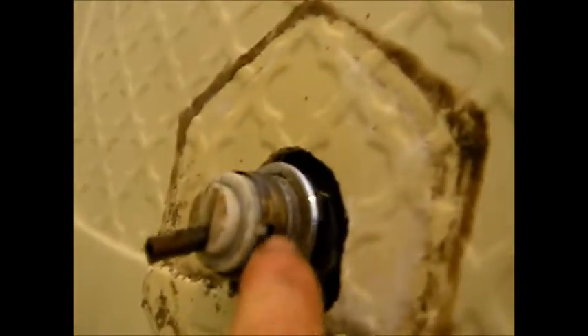We're gonna grease up that little control arm thing and possibly grease up the face of the washer when we put it back. Got it all back together - the trick is this little notch, you gotta make sure that notch is in there and things flush up against there. When you put the screw facing back on, I'm gonna put some pipe thread sealant on those threads. You want to make sure that this plastic piece does not move when you're putting this back on.